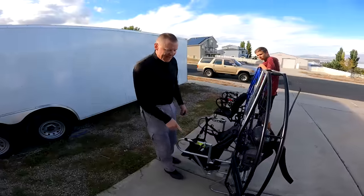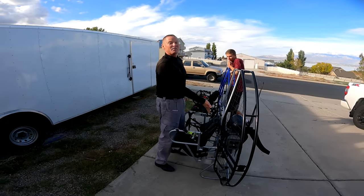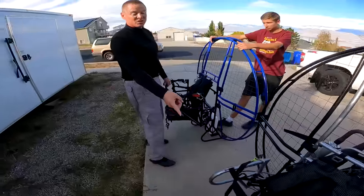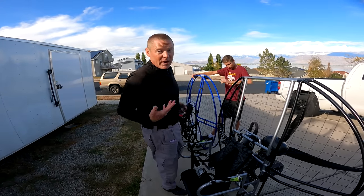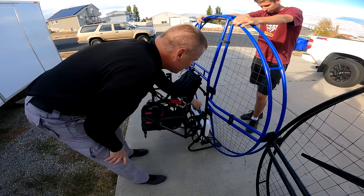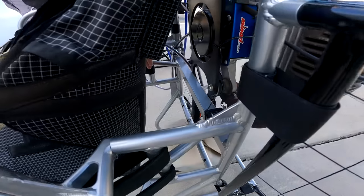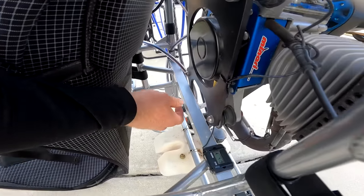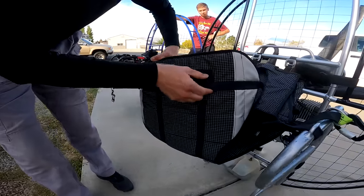When you're slamming sideways or take a massive collapse with dynamic loading, you definitely don't want your comfort bar snapping off. When I designed this I actually folded the comfort bar all the way in to make sure that even fully bent it won't break. I've crashed and folded comfort bars in so hard and they took enormous load — I've never even been injured. I made this piece incredibly strong because testing showed it needed to be the stiffest point. Your substructure and lateral support must have this strength — it adds very minimal weight.